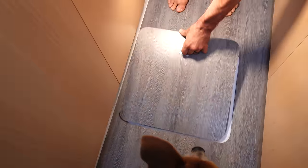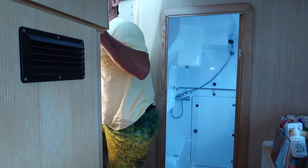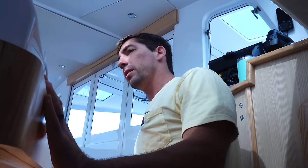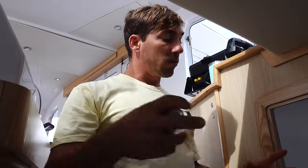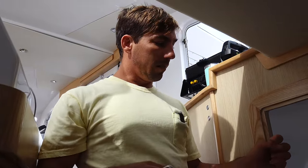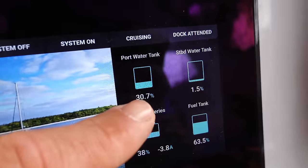Got a vacuum in there. And we should start to see our water level increase. We should be making close to probably 36 gallons an hour or so. We're making some water. And then we have the brine water, everything that gets filtered out through the membranes. Kind of gets flushed as brine, and that's going overboard right now. So we're done making water now.